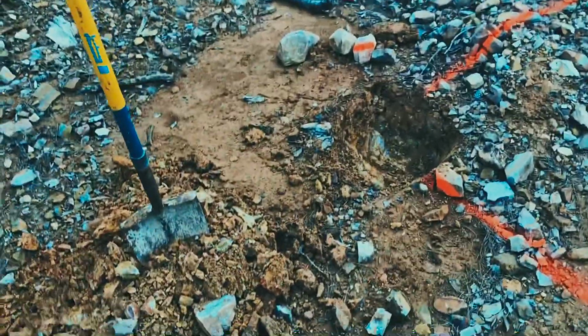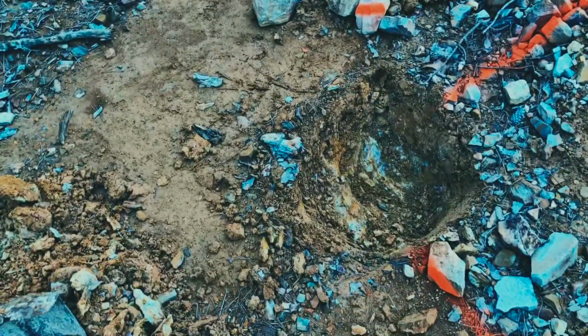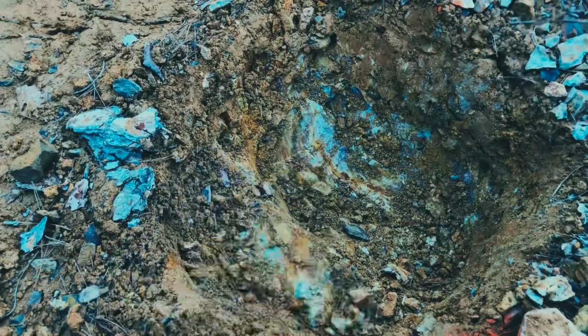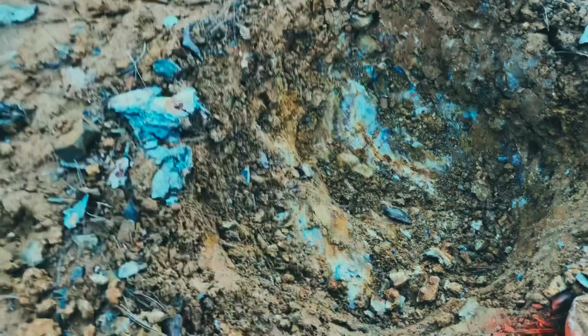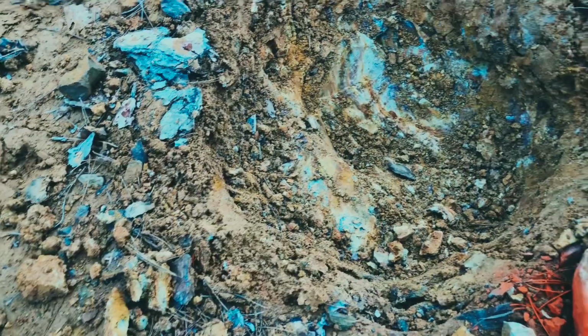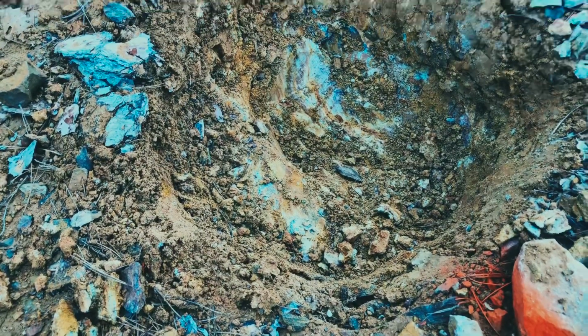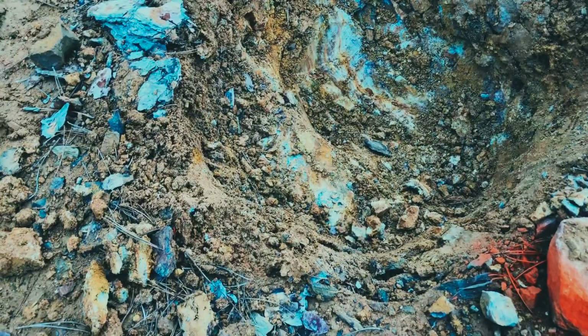Afraid that might be it for today's video. I'm gonna have to pick up definitely some heavy-duty post hole diggers and probably a freaking 6-foot rock bar, because just a regular shovel and post hole diggers ain't gonna cut it. If you can kind of see, that's solid rock right in there, and it's not a hard rock. It's basically compressed slate. Some of it's softer than others. Some parts has flint mixed in with it, which is pretty common around here, especially on the mountains. So it can be pretty hard, but like I said, I'm gonna need a really heavy rock bar to be able to bust through that.